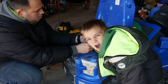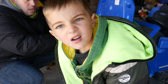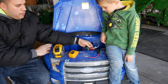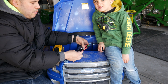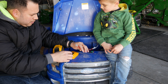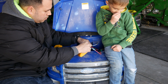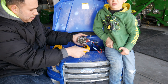Here's a recap of what we've done: we've taken the DeWalt battery to USB adapter and cut out the USB part, so we just have leads coming out. We chopped off the Power Wheels proprietary connector off the truck, wired in our DC power controller, and put in our inline fuse. At this point I think we're ready to start plugging stuff in. I'm going to hook up the battery adapter to the inline fuse as well as the negative directly to the lead coming off the controller. This is what we have here in the compartment — this combination of stuff.